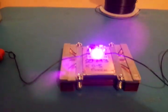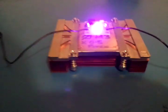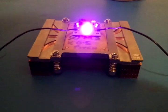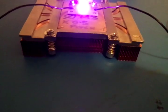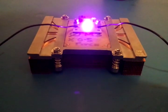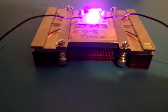As we can see, the LED is extremely bright and the manufacturer rates this to anywhere between 700 milliwatts per centimetre squared all the way to 2500 milliwatts per centimetre squared. If we turn it over we should be able to see it illuminating areas on this mat — there you go, all those bits that are fluorescent. If we take the light away we can't really see those.